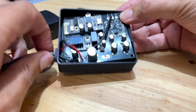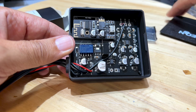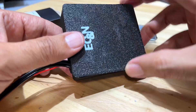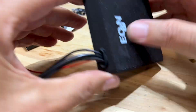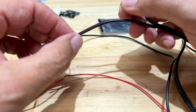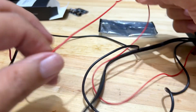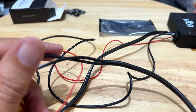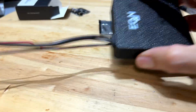This thing fits — the wires are a bit stiff but it does fit and it'll just click in there. There we go, clicked in. I haven't finished because I haven't soldered those pins on this side yet, but this is what it's going to look like — just clicks in place. These wires go off as mentioned: 6.3 volts here, zero volts from the heater supply here, the high voltage from the magic eye which switches this off when you've got radio connected, and of course the audio goes to the phono input.